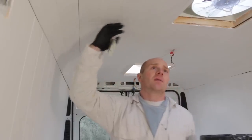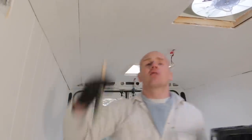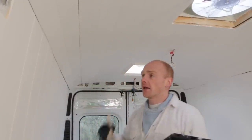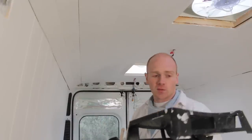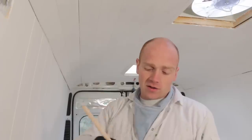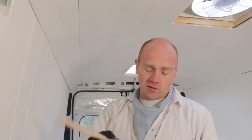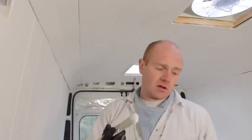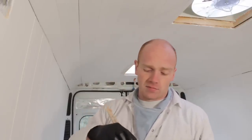So I've been over and rubbed down the ceiling, any kind of rough spots, and I'm going ahead with the paint now. I'm using eggshell, which we use everywhere in the house. Just an acrylic eggshell. Goes on really well, it does dry very, very quickly. So I water it down a tiny bit, but also turn that heater off because that's bound to speed things up faster than we want.